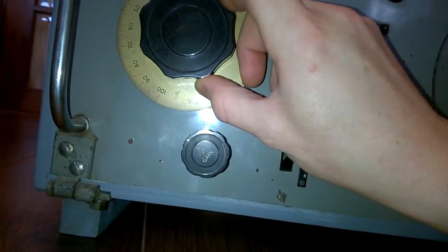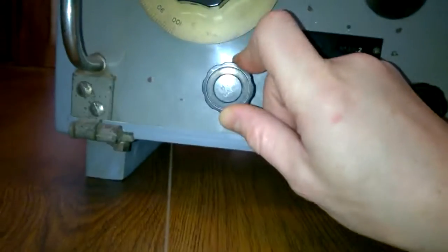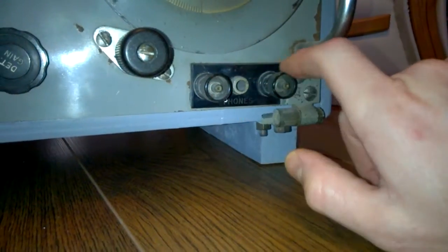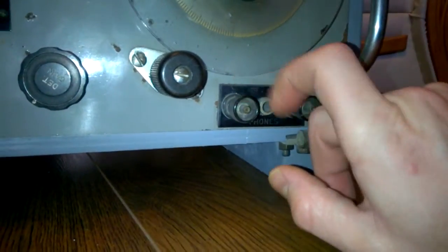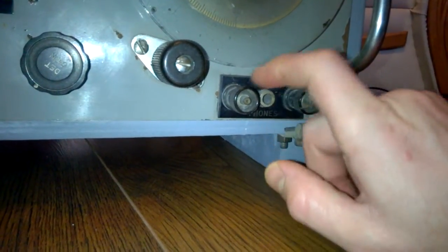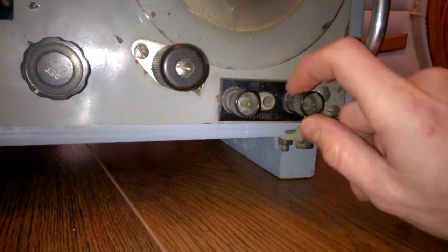Fine tuning here. There's a high frequency coil and detector coil — those are for tuning. Something similar over here connected to another capacitor on the other side: high frequency gain, detector gain. That must be linked to these controls. There's another on/off switch — possibly main power. And these sockets are where your headphones would go. You could quite happily hook it up to a modern amplifier or even computer speakers if you wanted.